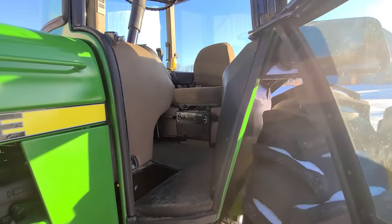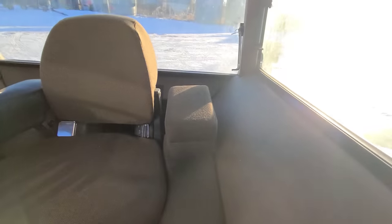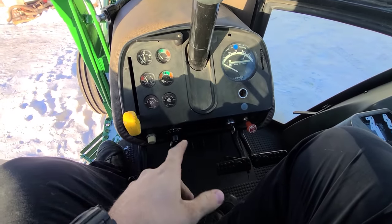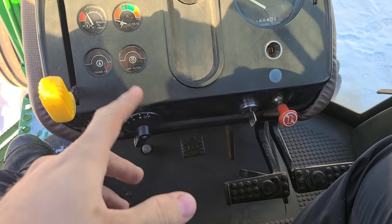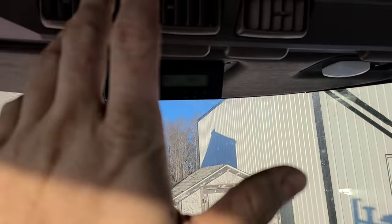Converted to two 12-volt batteries instead of six. New steps. All new 50-55 series cab kit, including buddy seat. We went from black to the brindle brown in here. Fixed all of the wiring in the dash because it was just cooked — packed full of dirt and all corroded off. All new decals in the cab, updated vents.